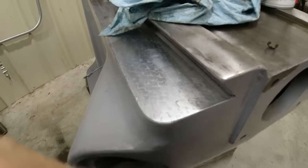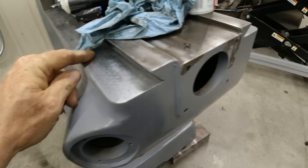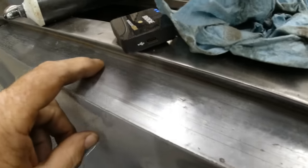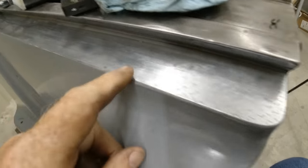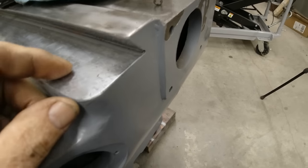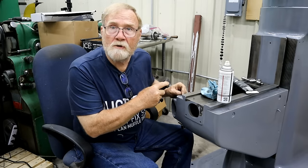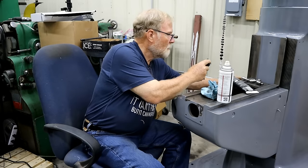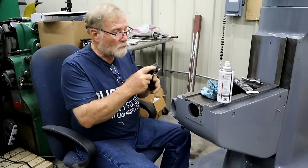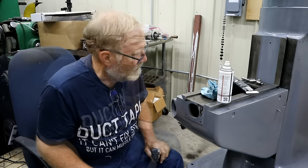See if you can see here. This way has flaking on it. And if you look down, let's get this out of the way. If you look down, you can still see the flaking all the way down. Well, this flaking's only a couple tenths thick. And I'll tell you something else. It's purely decorational. And something even worse, it's damaging to your machine. So, right in here, it's a couple tenths thinner than up here. And on this machine, I'm not going to worry about a couple tenths. The benefits of the chrome outweigh that little bit of wear.